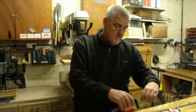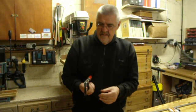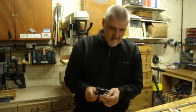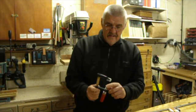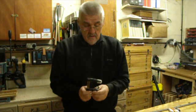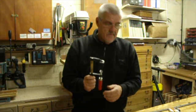The other is some of my F-clamps. These plastic covers that are on them, I find them a real pain. One is that they drop off, and two is that the bottom ends up splitting, then dropping off, and then you've got metal onto your wood, which then produces a very ugly mark, so you end up having to put a block inside. So I'm going to see if we could do something to improve that.